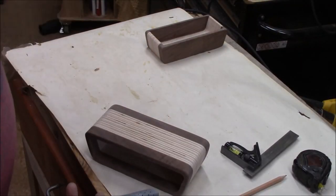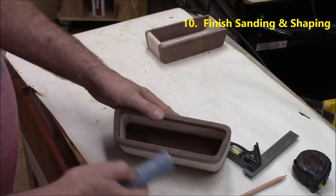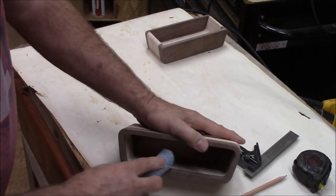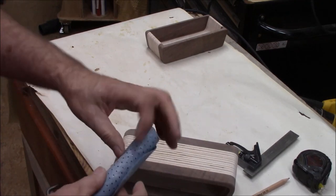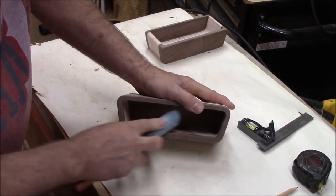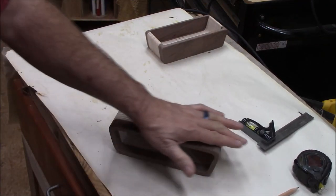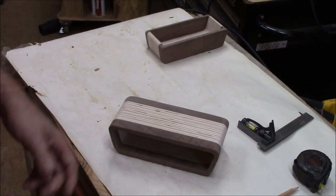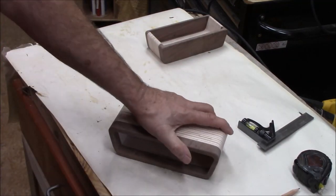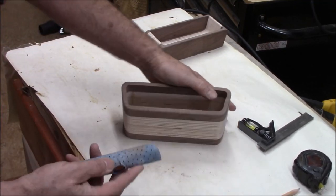There are numerous ways to put the finishing touches on boxes. I like to round over all the edges pretty well and kind of blend them into the drawer. You can use power tools, but quite often I'll just use sandpaper wrapped around a dowel or a piece of copper pipe — just try to get that radius. You can even put it on a router table with a round-over bit, a one-eighth or three-sixteenths round-over if you'd like. I like the handmade, handcrafted part of some of it. Sometimes you just have to put some craftsmanship in it and do it yourself.